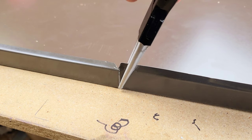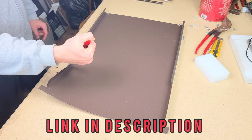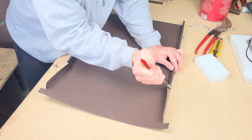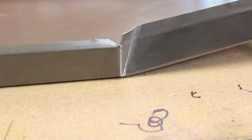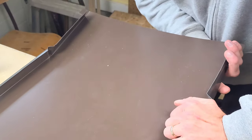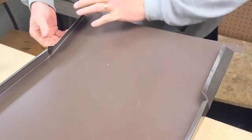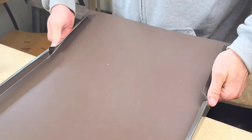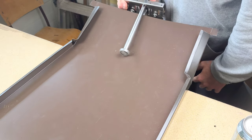Starting to form the pocket — you can use a pair of needle nose pliers; these ones I get at a specialty tool store, which I'll link in the description. Basically we're twisting, like you can see me doing here, and you can see the top panel already start to want to lift. These are the notching and folding techniques which allow this panel to be folded up — I'm folding those top seams down, and you'll see why in a second.